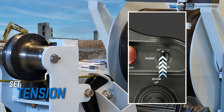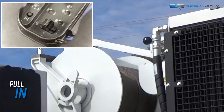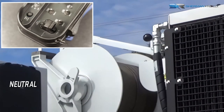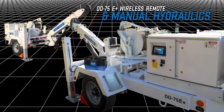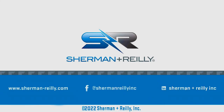Set the desired pulling tension. Use the reel payout pull-in paddle to pull the line in at the desired speed. To stop the pull, bring the paddle switch back to neutral. This concludes the video overview for operations that can be managed by the remote control and the manual hydraulics operation on the DuckDog E Plus. Be sure to read and understand the operator's manual before conducting any operations. Thank you for choosing Sherman & Riley.